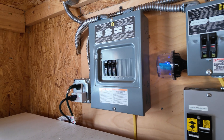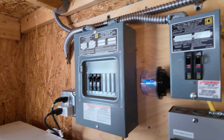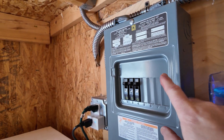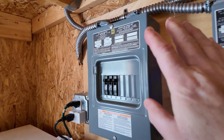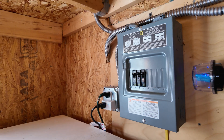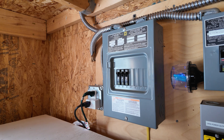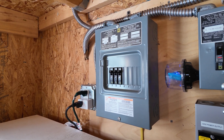I think I'm going to move my 120 volt AC power — my grid backup power — from this box, and just feed this load panel. Obviously, disconnect it from the solar equipment, and just have this running in the background. So I'll have power to the shed, I'll have lights, I'll have outlets, I can heat my batteries as I'm currently doing right now. I can also work on and off on the project and not have to worry about a timetable.